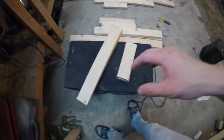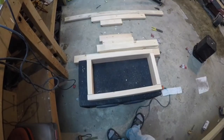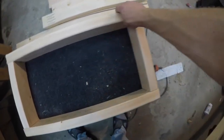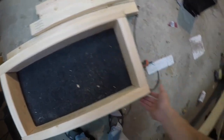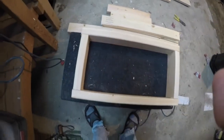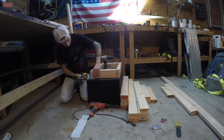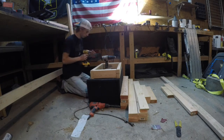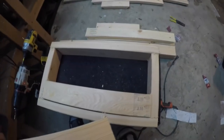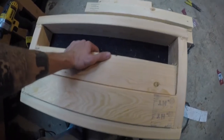For this first step, we're going to need the 24-inch pieces and the 10-and-a-half-inch pieces — this is going to make your seat. First, you want to put the smaller piece on the inside and make sure the 24-inch piece is on the outside. Go ahead and drill in — I'd say put two screws in each one. I've got that screwed together now. I'm taking my 18-inch pieces and just putting them in there like that, and that's going to form our seat right there.